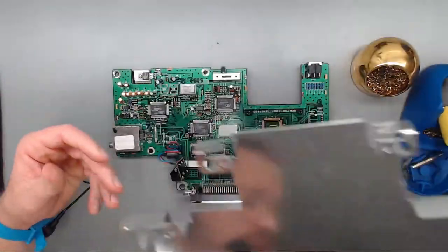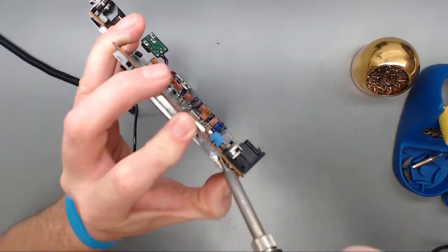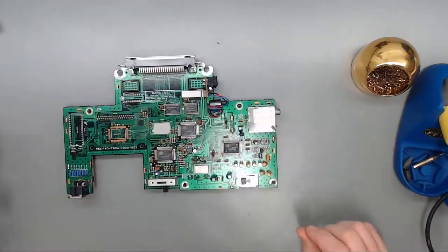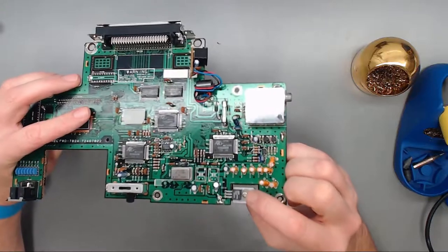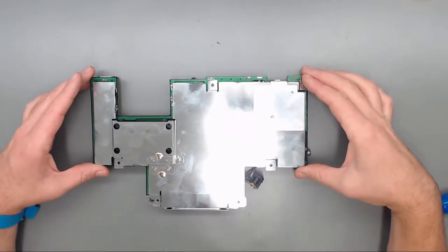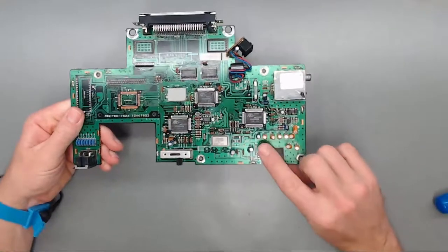With those two off we should be able to remove the shielding now, and there we go. We'll go ahead and continue removing the shielding on the top side. Also want to make note that while removing the shielding we'll have to disconnect the 7805 voltage regulator — that's just a Phillips screw. Now we have this other side removed and that gives us access to both sides of the board to get all these capacitors removed.